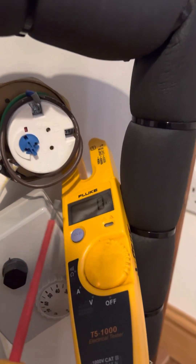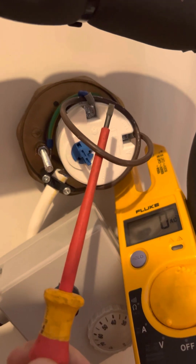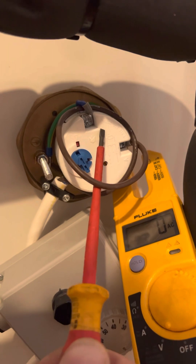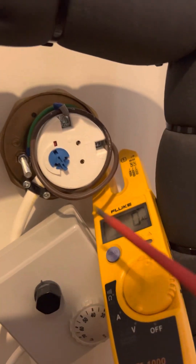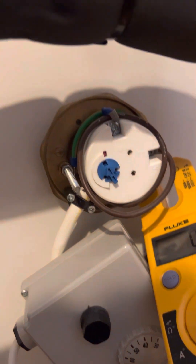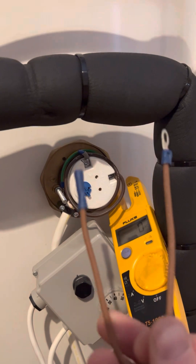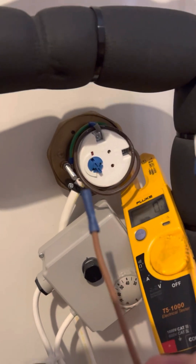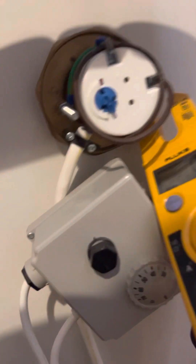If anyone's thinking about maintenance provision when they install it, they need to leave a nice big loop in the line conductor — or the neutral, doesn't matter — so somebody can take an amp reading to check if it's drawing or not. If the cable's been left too tight with no way to get a clamp meter underneath, you can do a safe isolation, crimp a connection on, extend the cable, so whoever comes in behind you has provision to take amp readings in the future.